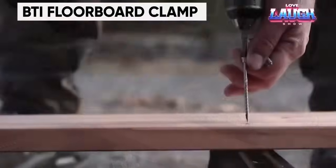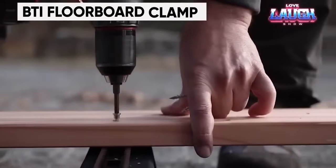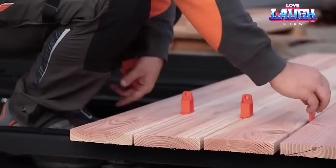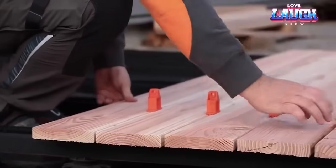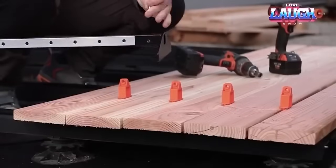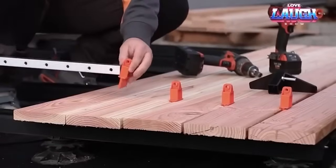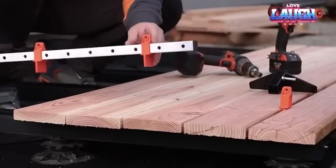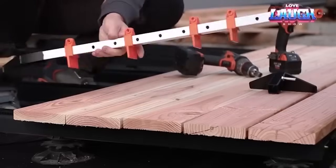This kit serves a dual purpose. Firstly, it enables the craftsman to accurately set the distance between the boards. Secondly, it can be used for tightening. Depending on the width of the boards, several sets are sufficient to tighten 5 to 7 pieces. The spacers have a thickness of 0.236 inches.